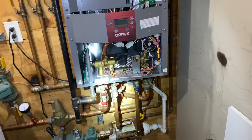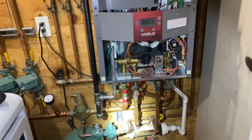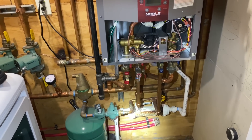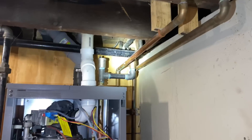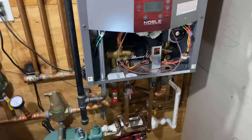Interesting enough, we are missing a low water cutoff — there's no low water cutoff. We are in Queens County, which is in New York City, and New York City is all about redundancy. Also missing the drip leg. It is what it is. We'll check our gas meter outside.